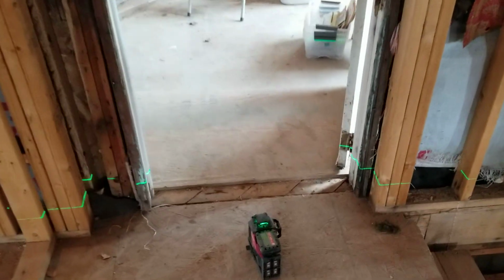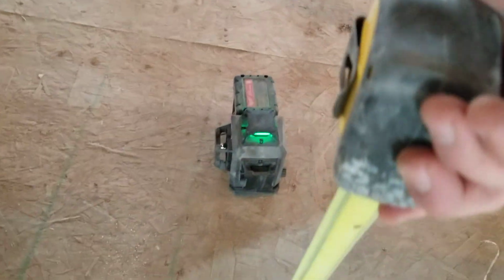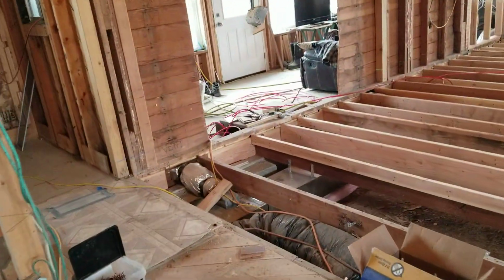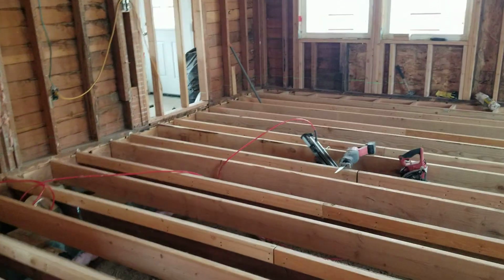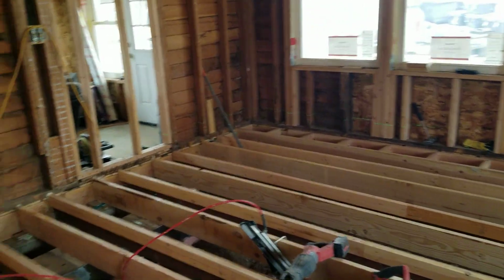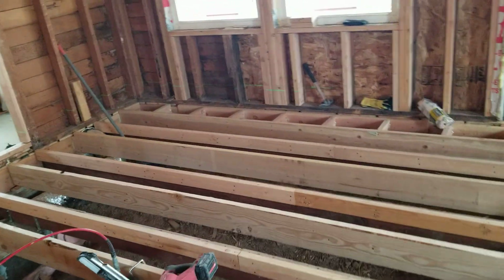So now what we're doing this time is, I've convinced the homeowner, after he saw the bad shape that his existing floor is in, I take my laser level at that 6 inches like I showed you, and I shoot this laser line all the way through the house. And now I'm going to top of frame, and I'm going 6 3/4, because I showed you my offset to laser from top of subfloor was 6 inches. Well, 6 plus 3/4, I need to go 3/4 down to top of frame, and that's 6 3/4.